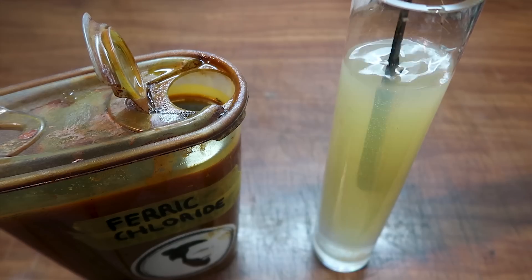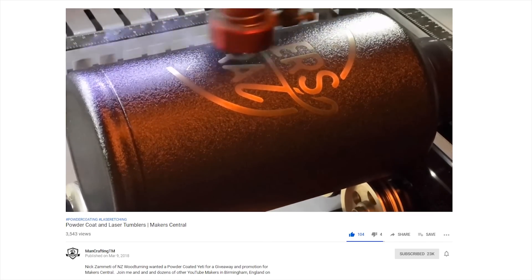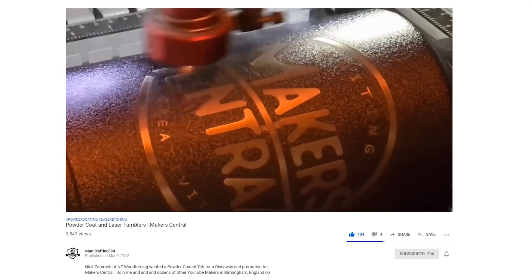Before I show you how I replicated the fake pattern, I want to point out that the process I used is not the same as the one used in mass production. I think this can be done in at least three different ways: the one I used is electro etching, then similar to what I did, the etching can be done with chemicals like ferric chloride, and finally the way I think fake damascus is actually made is with laser engraving — because laser engravers are CNC machines, so after you program them there's no need to make masks, you can make more complicated patterns, and it's also quicker.